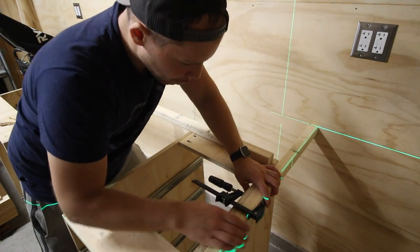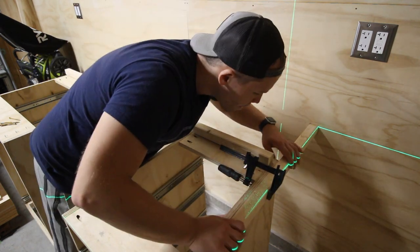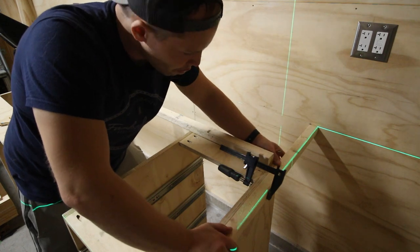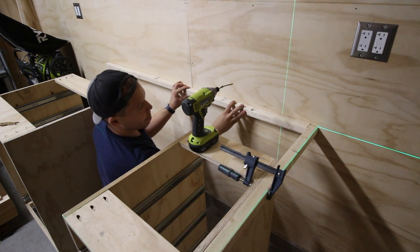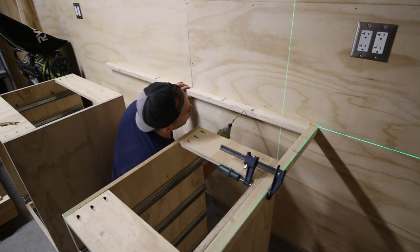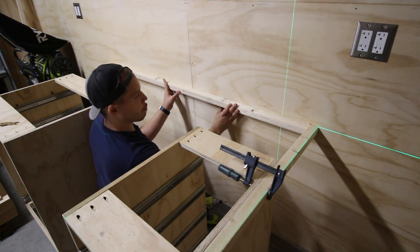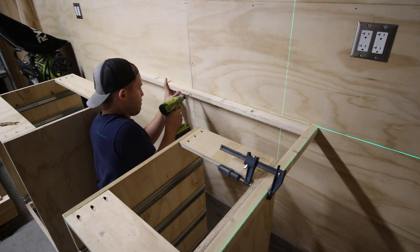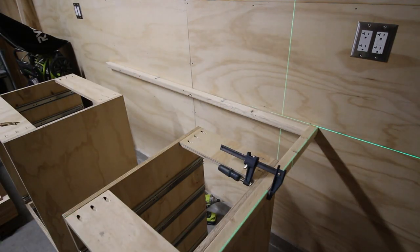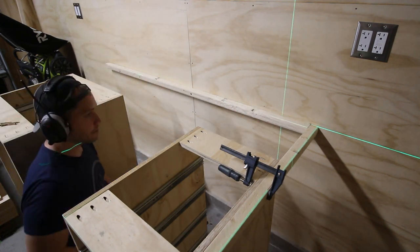To do this, I turned the lights down low and then used my laser line level to cast a line that just barely overlapped the front of my cabinets onto the wall. This was mostly just a sanity check, because to be doubly sure, I ultimately clamped an extra 2x2 to the top of the cabinet, flush with the top, and extended it out to the wall to serve as a guide for where my wall-attached 2x2 should be. With it properly positioned, I could use some long screws to secure the 2x2 into my wall's studs, conveniently marked by the black trim head screws I had used to mount my wall plywood to the framing.